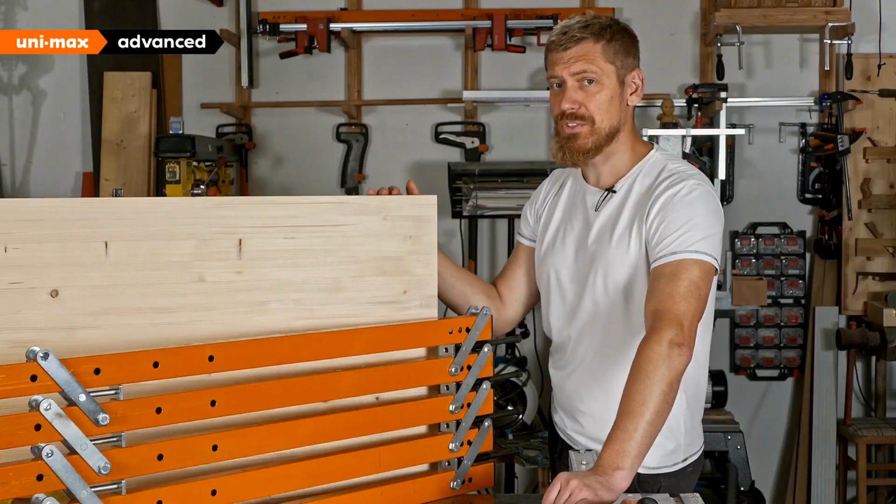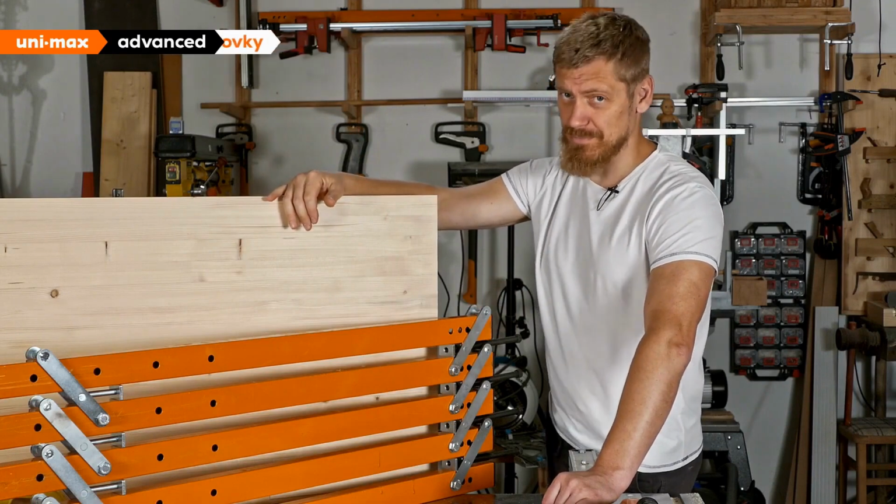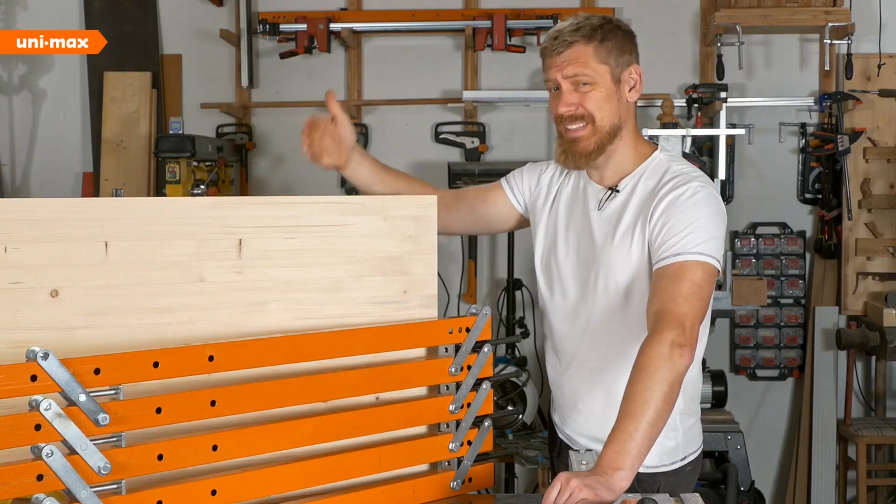So yes, it is generally cheaper to make a dimensional board from laminated wood than from a single piece. But what is perhaps even more important is that properly made laminated wood is stable and does not warp. Additionally, you can theoretically extend laminated wood indefinitely by gluing.